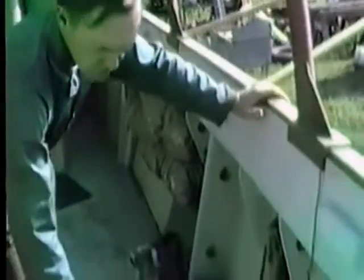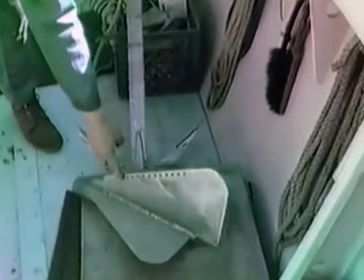The series of small holes there are for adjusting the speed. As the boat goes a different speed, the paravane wants to take a different attitude, and has to be experimented with slightly for balance of the paravane. There's one on either side. And it can reduce roll up to about 80%.